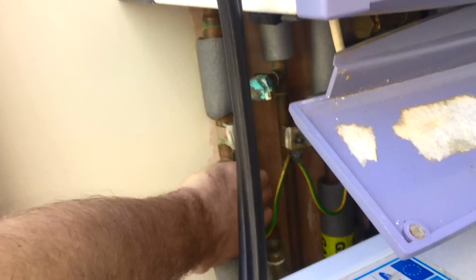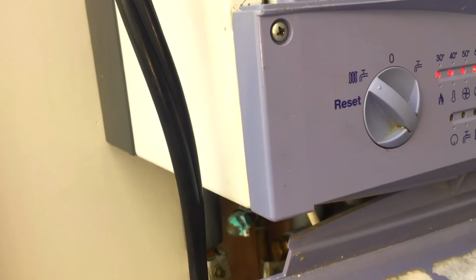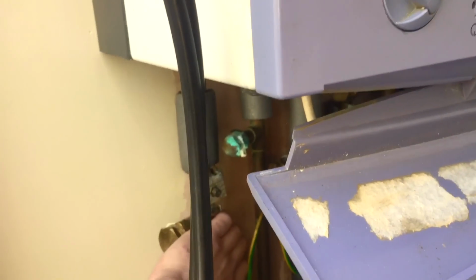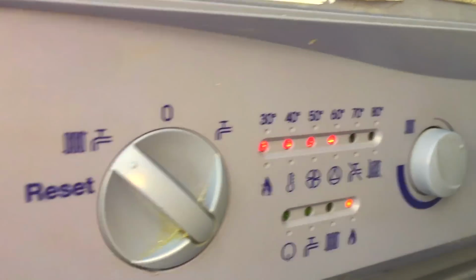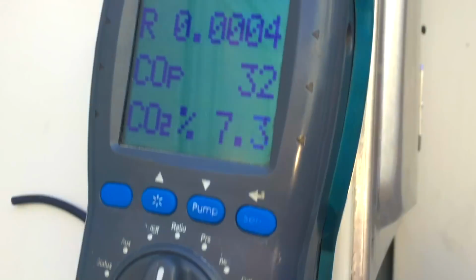And remember, even if this does get hot, then I would then take off the front water section, the domestic hot water flow sensor bit with the diaphragm. I take that bit off and move that spindle back and forth, and usually that'll fix it. But this is fixed, this is not getting hot at all. The boiler's at 60 degrees, and as you can see, I can hold this with no problem at all. Okay, it's not hot at all.